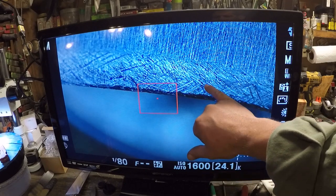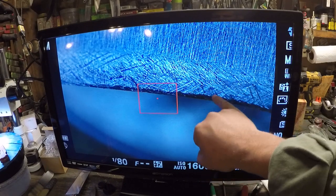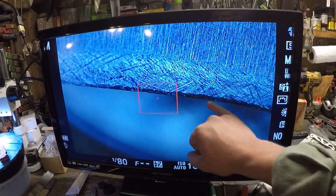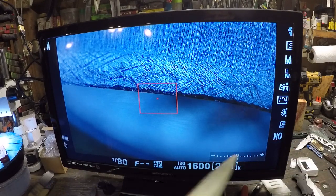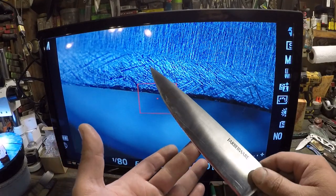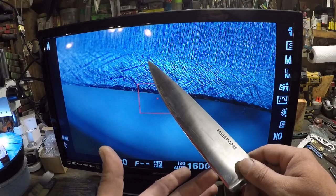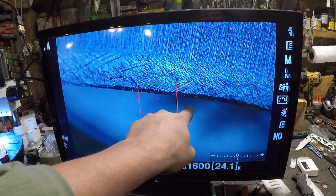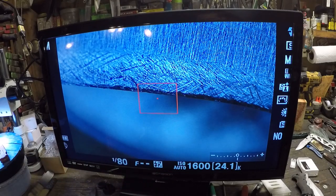Okay, so if I was sharpening this and bringing it to a burr, this would never happen. Because as I was feeling for that burr on this particular knife, I would have felt it up here, and then all of a sudden I wouldn't have felt the burr right in here because I didn't bring the edge bevel all the way down. Okay, so this is something that I can't quite see on the edge with the naked eye, but I'll show you something that you can see.